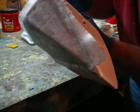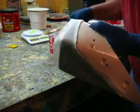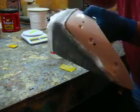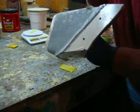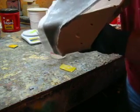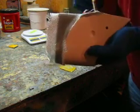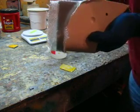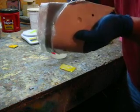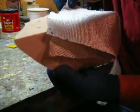I've tried making these movies of me doing this on two or three different occasions, and folks, this is dedication to you guys right here — this is not easy to do. I'm not the cameraman slash jet builder man. Bear with me, folks. We need to get some more resin on there because a lot of that's going to soak into the cloth. Anytime you're doing fiberglass work, if you're using 10 ounces of cloth — that means 10 ounces per yard — it's going to take about the same amount of resin as you're using in cloth.